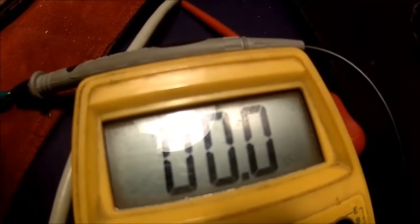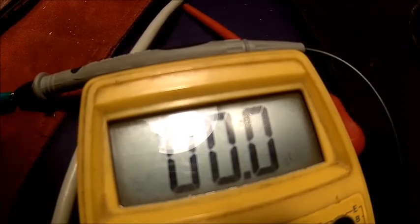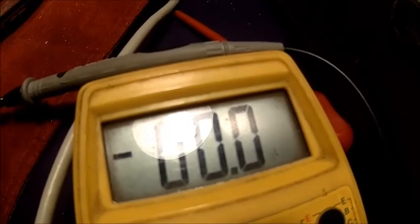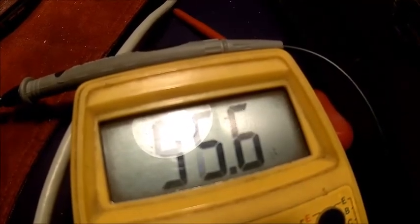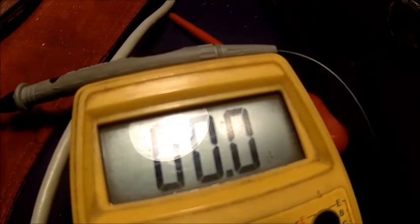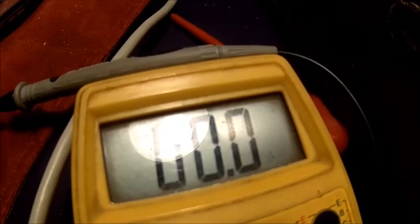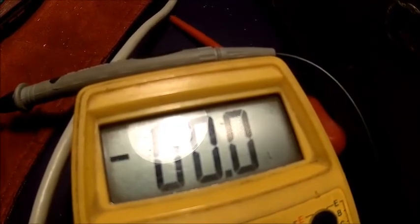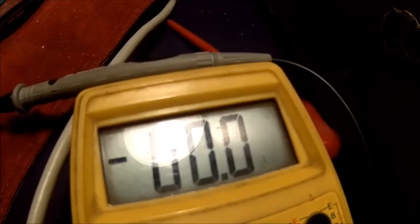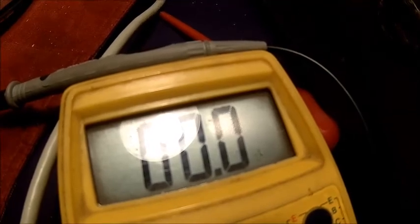That's good. The 50 volt unregulated is from the rectifier, so that's all good. That's supposed to be 110 here but it's reading 96 - that's not 110, so we need to check what's going on with that 110. There's probably a lot of ripple on it, maybe another fault somewhere. That voltage isn't clean.